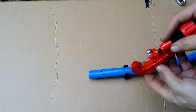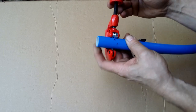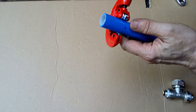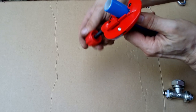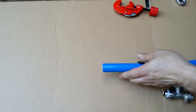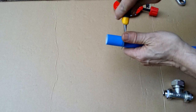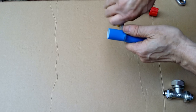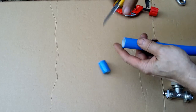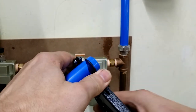I use those traditional cutters that make straight cuts. But the tubing is thick. The knife on the tool goes only past the aluminum layer, so I finish it with a regular knife. It cuts part of the inner PEX layer. Cutters that came with the kit are not good. They bend the tubing and the cut is not really straight.